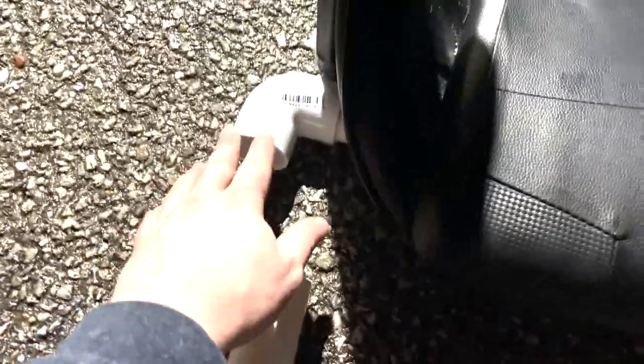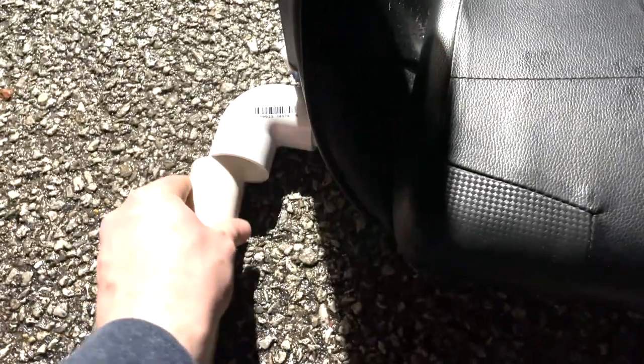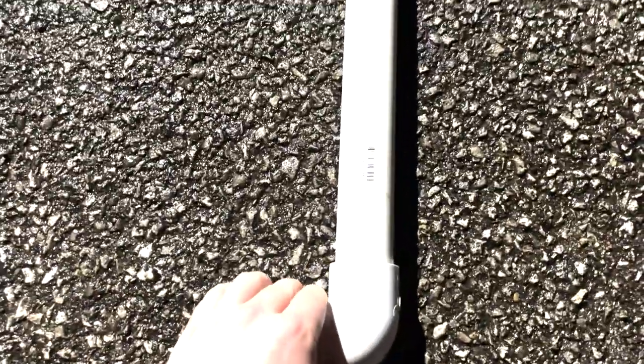Okay, so we're definitely going to want to use the purple primer coming out of the chair. You don't want to put it into the chair here, but coming out of the chair into the long piece, because there's gonna be a lot of stress on it. So you're gonna want purple primer in the small piece that goes to your knee, and then purple primer it to this joint, and then purple primer this to the L joint that we're gonna put on the end here. So all of this is gonna be purple primed together, because there's going to be a lot of stress on that part of the rig, okay?